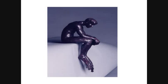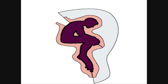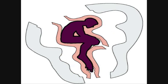So what is this whole process? Lost wax casting works like this. The artist makes the original artwork in whatever material, typically clay, and then a mold is made around it in order to create an exact copy. Again, a rubber mold is good because it can capture a lot of detail, and it's flexible, so it's easy to remove from complicated shapes. You have to create a harder plaster mold around it as a shell to hold that flexible rubber mold. Then you remove the original art and set it aside, and reassemble the molds.